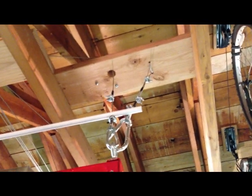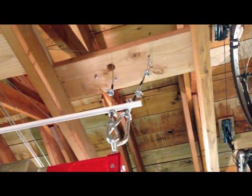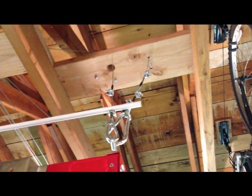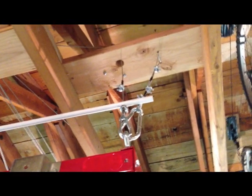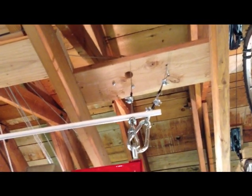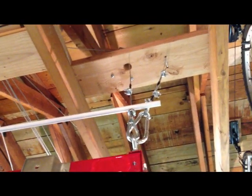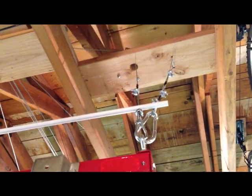It's kind of a safety redundant feature, since I park my car under this every day. There's a large carabiner and a small carabiner. The large carabiners are quite gigantic — a bit bigger than I anticipated — so I just use those as the static line carabiners. Each carabiner holds over 400 pounds, which gives ample weight-lifting capacity. The smaller carabiner is the one attached to the line that lowers and raises it — it holds about 180 to 200 pounds each.